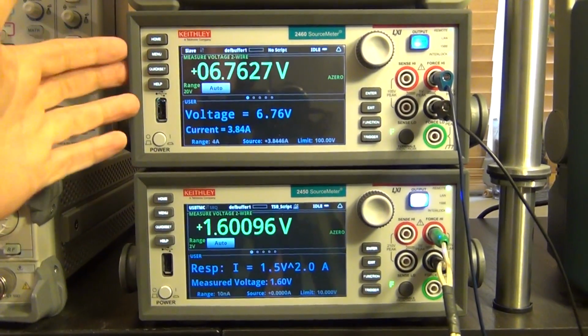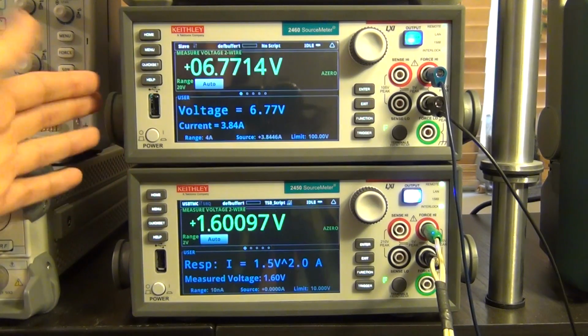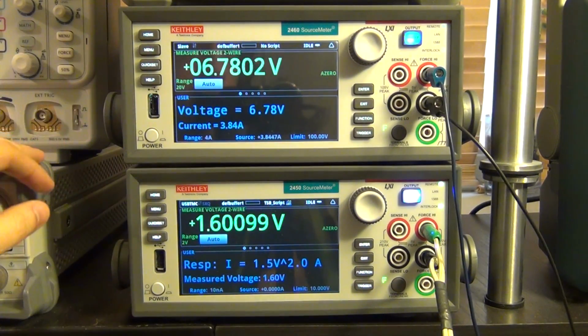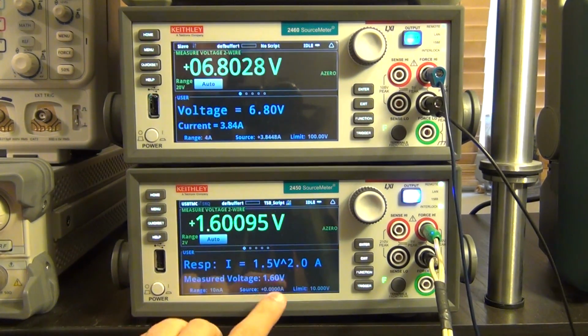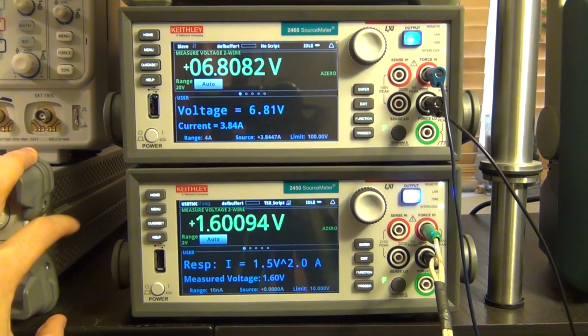So the transconductance equation between here and here is given by that. Now, of course, depending on how fast you want to run this loop, it's going to run into the limitation of the interaction between these two units, but you can program this to indeed respond very, very quickly and have even some transient response from this, even though it's meant to be more of a DC characteristic. But nonetheless, we can see how easy it is to program some complex equation between these two units and get some really interesting IV characteristics.